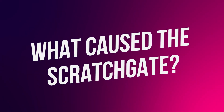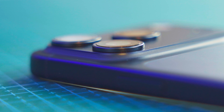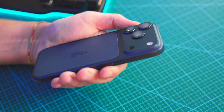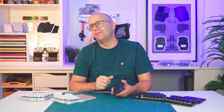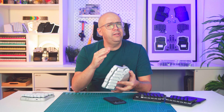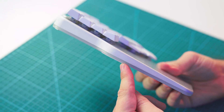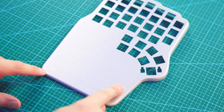So now that we know how aluminum is anodized and how well it protects it, why does the iPhone scratch so easily? The answer lies in design decisions. The camera bump has very sharp corners, which means there is less surface area for the oxide layer to grow evenly. As a result, the protective coating ends up thinner and more likely to scratch — that's where Apple's design choices meet the limits of physics. This is something we purposely avoided when designing the top panel for our keyboards. The corners are rounded, and wherever there is a sharp edge, another element protects it, like where the top panel meets the base. Even the holes for the switches are slightly chamfered to help prevent scratches, and the sandblasting and brushing also help smooth out any sharp edges.